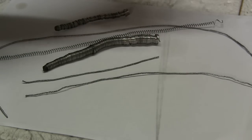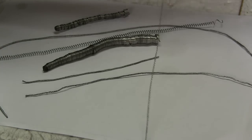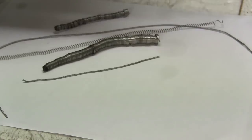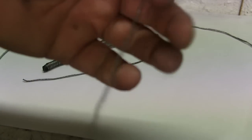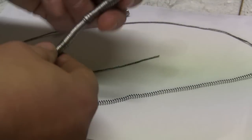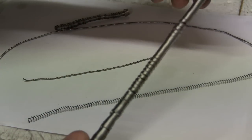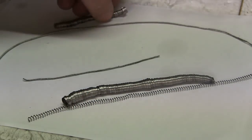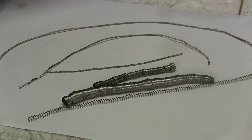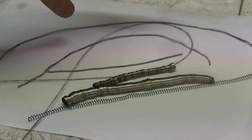Every time you look in their catalogs, you see these big, huge, curly chips coming down, and you think, man, that almost looks artificial. But they're just super cool. I just love these things. Right, here's a little curly Q here. And then this was a big heavy cut, probably 100 thousandths taken off. But this is the kind of chips you'll get if you hone your tool and you grind it properly and everything is set up correctly, and you got the right rigidity and the speeds and feeds are correct. So there you go. Hope you like my new segment, Chip Hall of Fame.